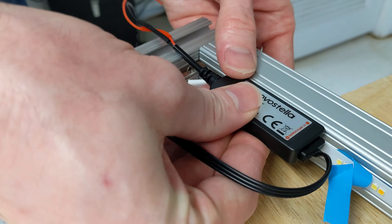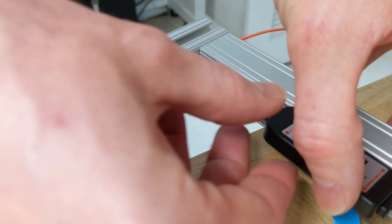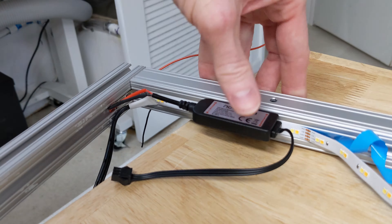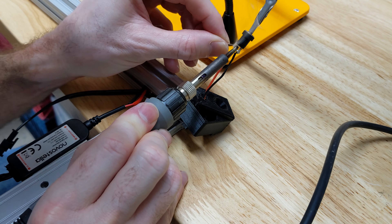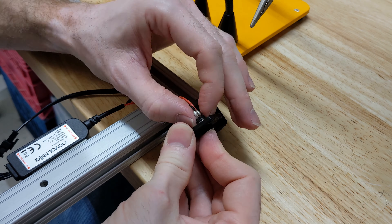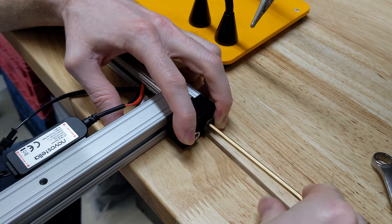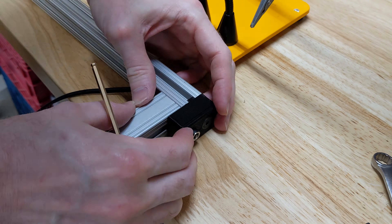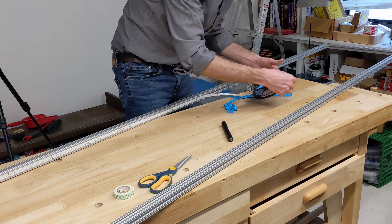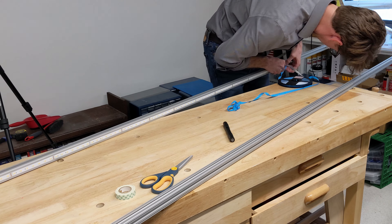There's a small gap, just large enough for one wire, between the L-shaped connector and the extrusion on each side, so we can fish two power leads through and connect them to a DC barrel jack. I'm sticking this thin controller onto the flange closest to the wall. Although I'm bridging the slot with this LED strip, it's sticking really well to the small bit of flange on each side and fits inside the grooves as though it was made for this. You could fish it into the slot if you wanted, but this is easier and works better at the corners.